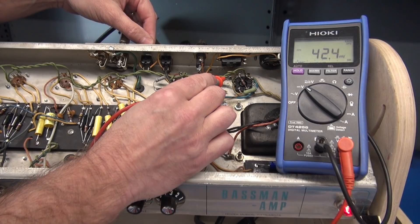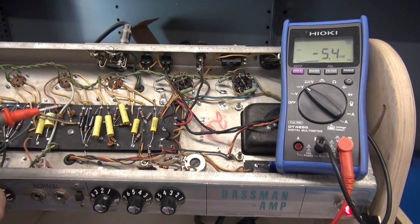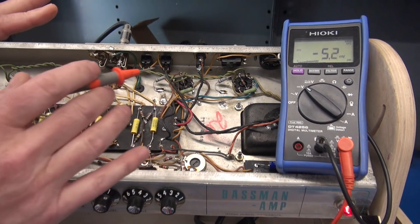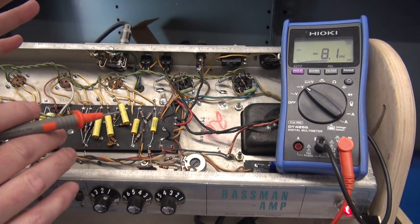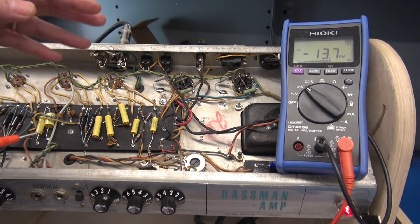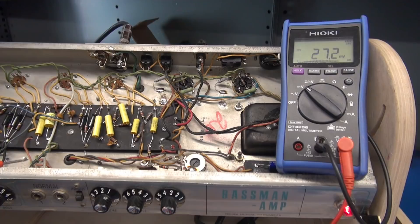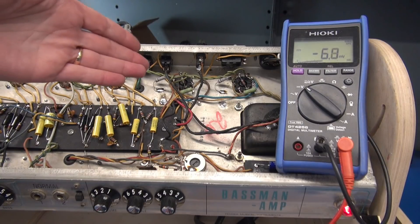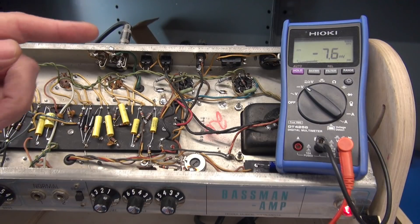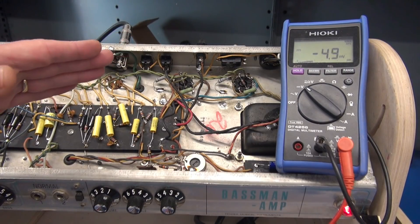And if we go over here and get a good connection, we also have about 42 milliamps. So if it was an imbalance situation, you would adjust the pot and adjust these for the same bias, but there was no way to actually see the bias because they didn't have any current sensing resistors. To perform this today you would have to use one of those external bias adapters. This is why I routinely put in these resistors, but that does not solve the problem — we're still seeing over 40 milliamps of idle current on the 6L6s, which is pretty high.